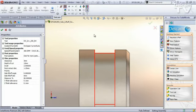We have a range of 0 to 90, so if you set it at 90, it would plunge, but then it would drag back across the face in the horizontal. So in this case, since it's a square groove, we probably want something in the middle. Of course, this is going to depend on the actual geometry of your groove. So I'll set this at 45 degrees, split the difference, and we'll set a side lift-off distance of 0.5 millimeter.